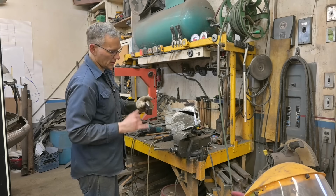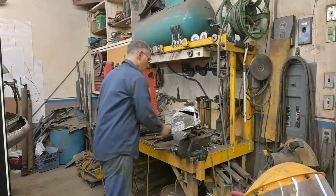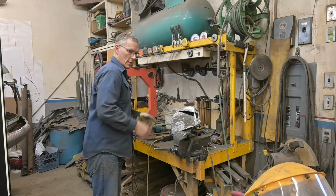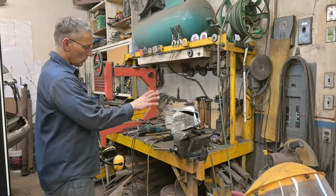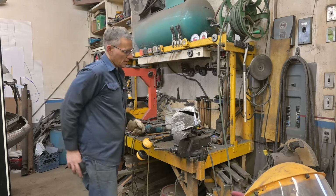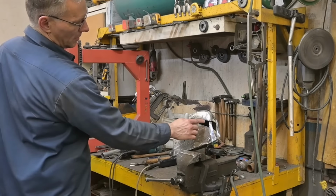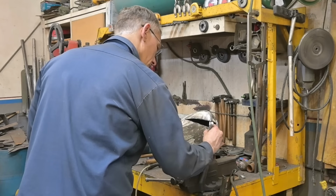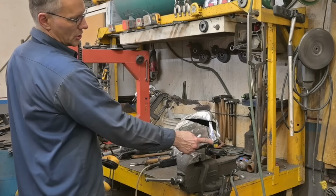So I removed it entirely. I had some pretty big spot welds in here just holding it in. So this is gone for now. We'll probably put it back later because we don't want this thing pivoting on one bolt. And yes, let's start trying to form this into the shape we need. Easier said than done. Oh yeah, we have to do one more cut, because when this rolls up, we're gonna be shorter than the end. So I also need to take a wedge out of here, on both sides, to bring the end up. This is gonna match up with the quarter panel.